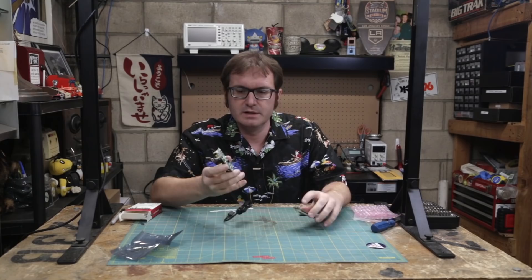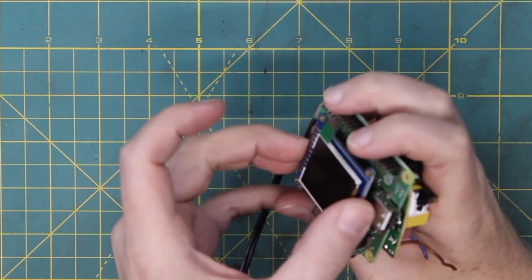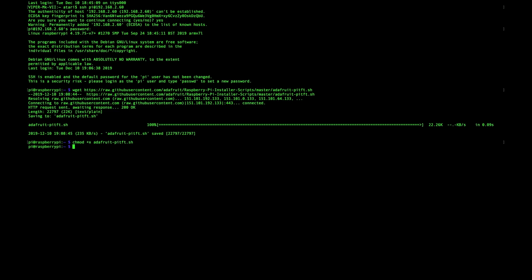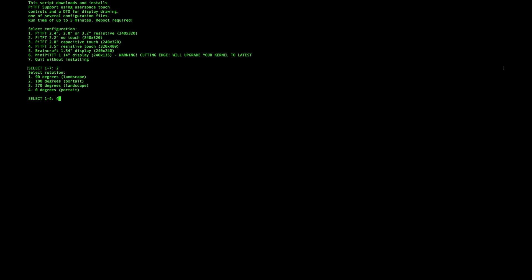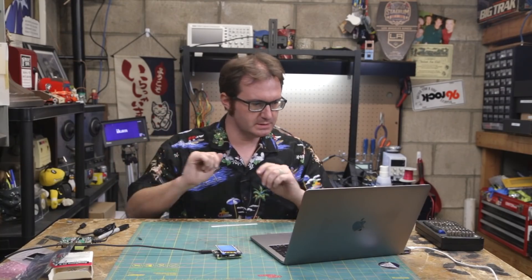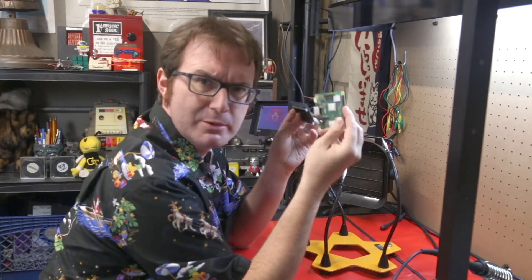Let's grab that board. I should be able to sandwich it with a little insulation, run the wire over to the power end, put a screen on there, and put it all inside a neat little case. Let's go ahead and get Raspbian put on this thing. Let's get the screen set up — we'll SSH into the Pi and run the installer script. Change mode. Number two — let's do that one. Would you like the console? No. Would you like the HT? Yes. Reboot!